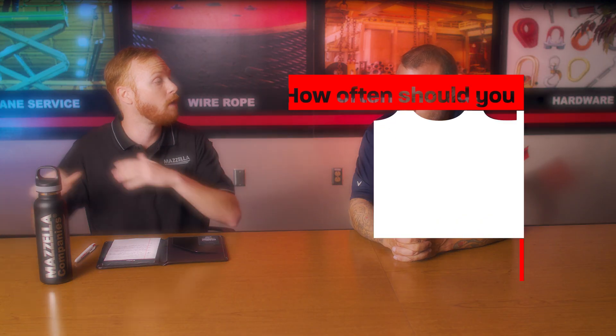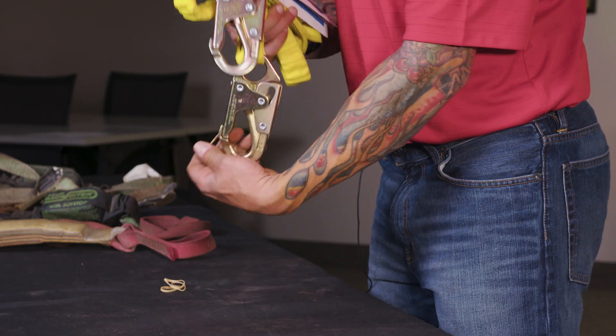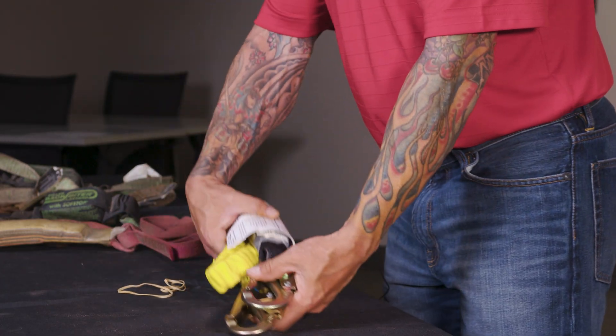The first thing I want to ask you is how often should you get your gear inspected? There are going to be three answers to that. The initial inspection is when the rigging gear arrives to your facility — this could be either new product or repair product. The second is the frequent inspection, which is the inspection by the operator at the beginning of each shift, or depending on severity, prior to each use of the item. That's a non-documented inspection.